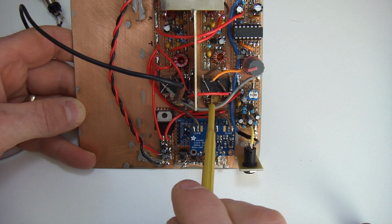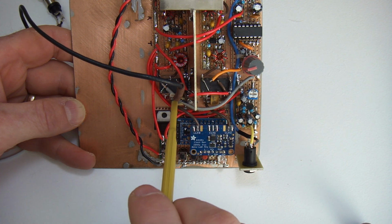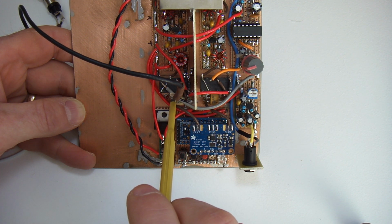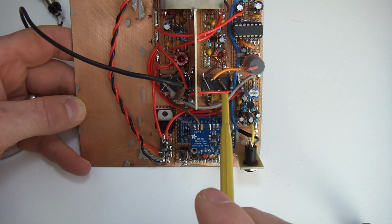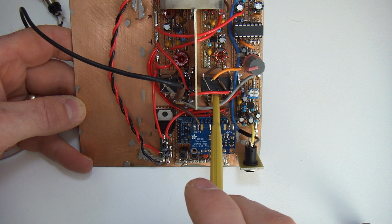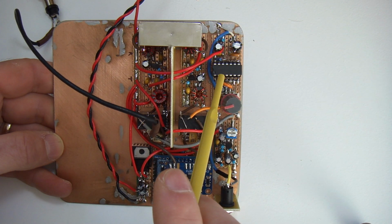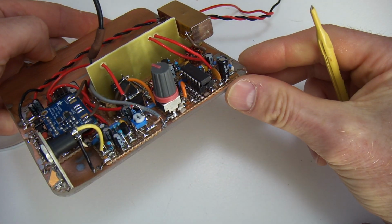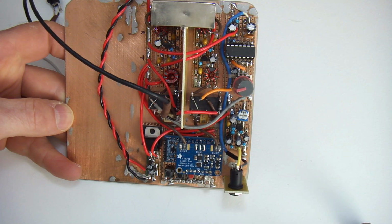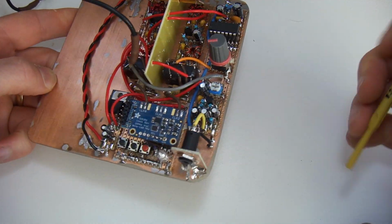And then back into the product detector, which now is an ADE-1. Same with the mixer on this side, both ADE-1s now. Nice small size here, nice and compact. The output of that is now audio on reception, which then gets fed up here into our audio amplifier using that LM380. So that's working out nicely. And then that's being fed down through that blue audio cable down to this connector here.